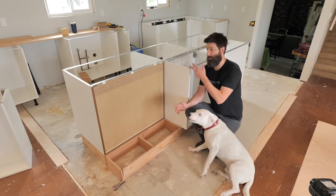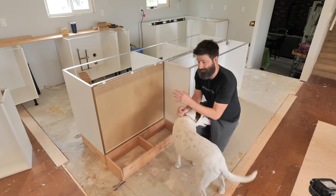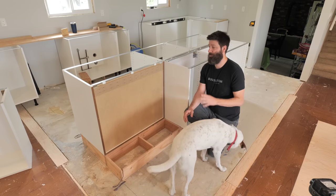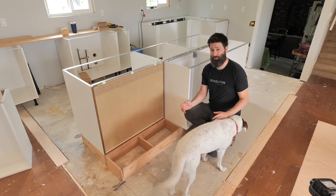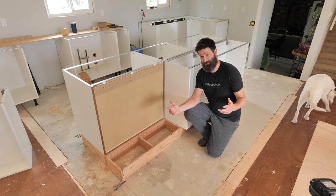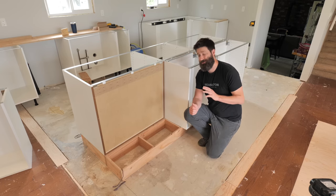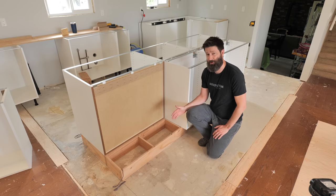If you're putting in your own cabinets, maybe from Ikea or the big box store, they have those plastic little adjustable legs with the track that goes on the wall. But if you're putting in a big island, you definitely don't want to use those plastic legs — put a 500-600 pound countertop on top and the whole thing is liable to tip over and kill somebody. So I'm going to show you how to build a rock solid kick out of three quarter inch plywood and my amazing method for getting it perfectly level and rock solid to the ground.